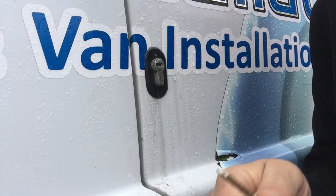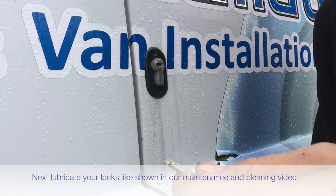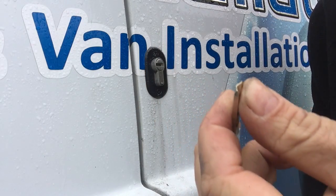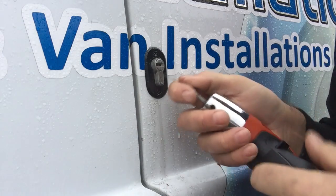Try your spare key first — that's the first thing to do. Spare key, lubricate the locks as shown in the other video. Other than that, it might be a case that we can clean up this key if you don't have access to the spare key, or perhaps one of the pins could be jammed with a bit of dirt.